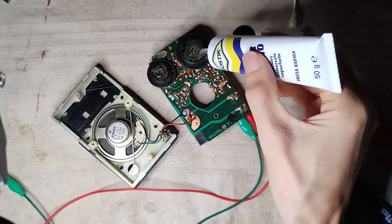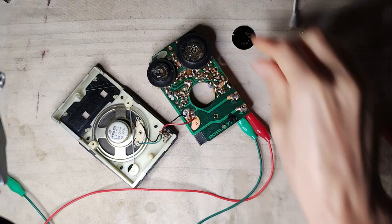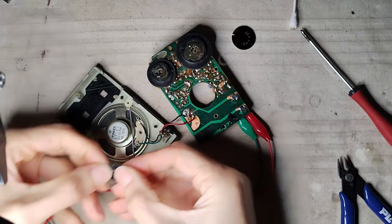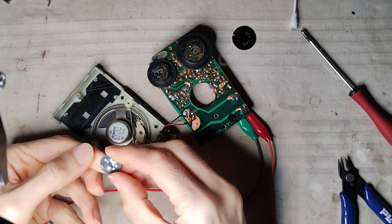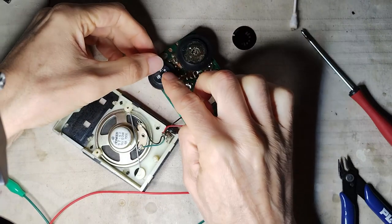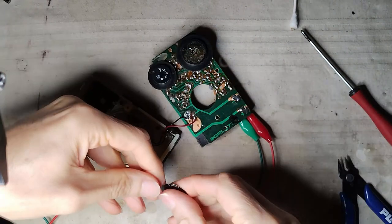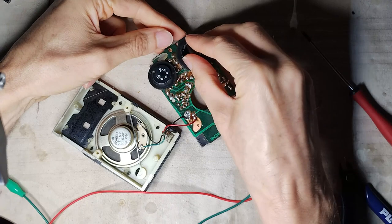The knobs have a small reference that allows to put on top the graduated scale with the right orientation. However, first the knobs must have been installed oriented correctly. In this case, both knobs have been inadvertently installed rotated 180 degrees. Later, when the issue is discovered, it is fixed, but off camera.